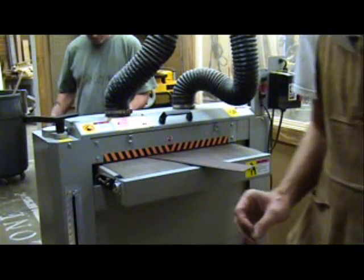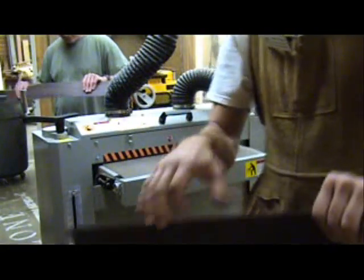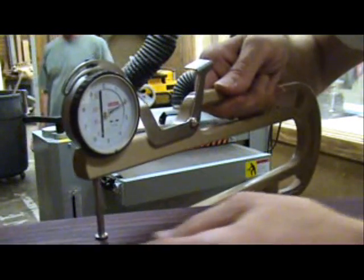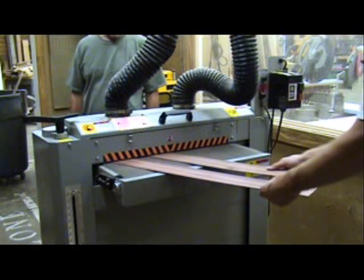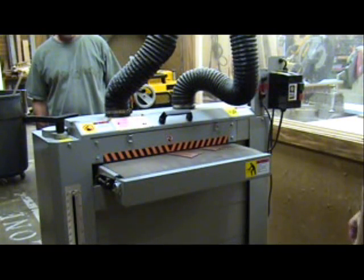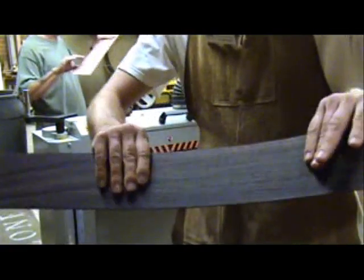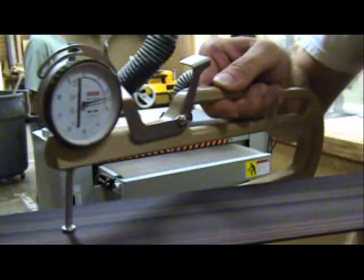One of the sets of Indian rosewood has really started to relax, and I think it's ready to bend. The final thickness on this set of sides came in at about 2.2 millimeters, or around 86/1000ths. The bubinga and the palo escrito are still on the stiff side, so let's send those through again. This next set was the stiffest of all the sets of Indian rosewood that we thicknessed, so it needs to go through the sander again.